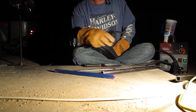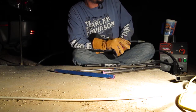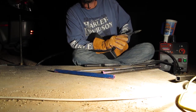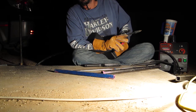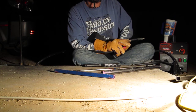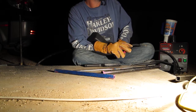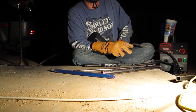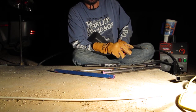All this talking has been so the welder can cool down. This cheap welder is a 20% duty cycle, which means for every two minutes you weld, you have to wait eight minutes for it to cool down. You don't need a stopwatch because it'll remind you by tripping your breakers.